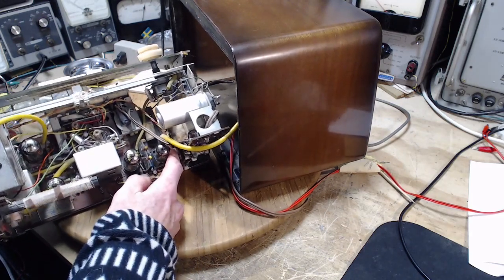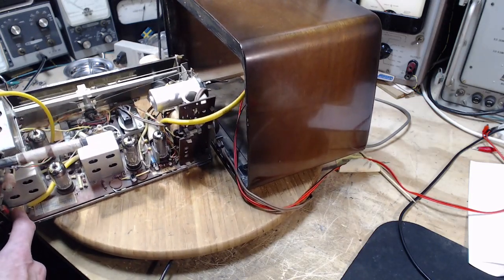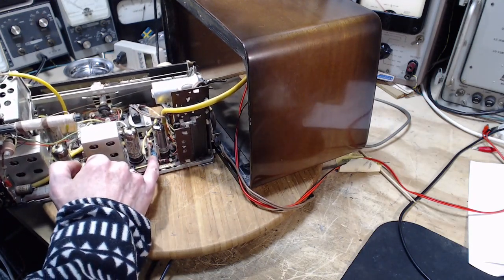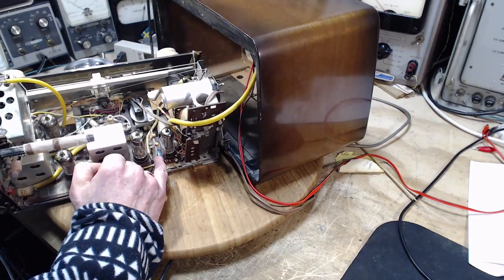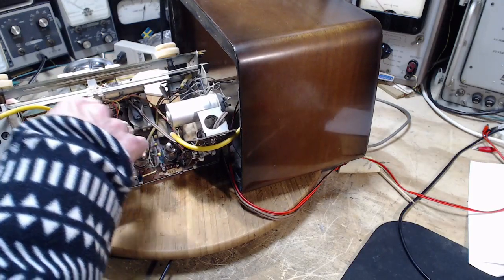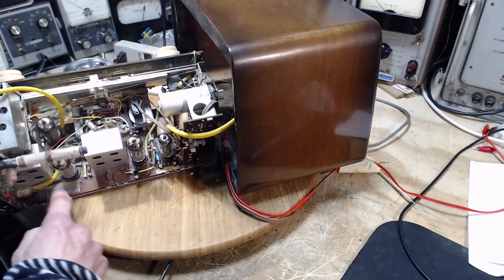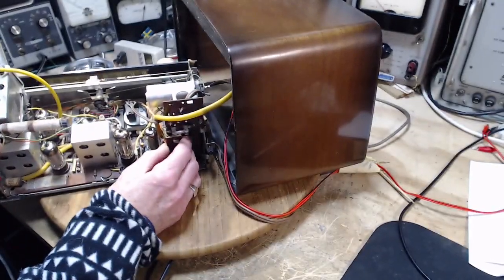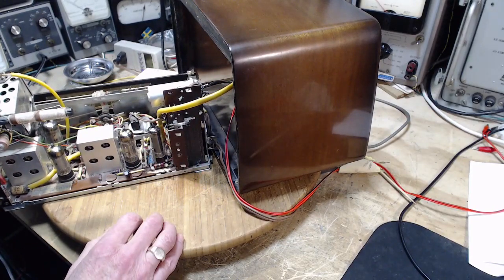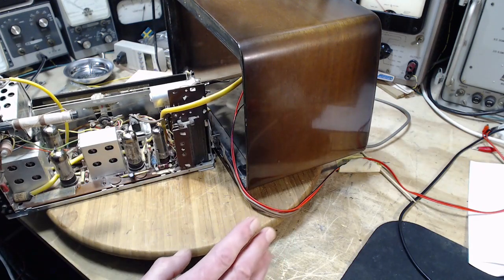Aside from that, there's one over here. It's pretty easy to get at. And wasn't there another one? So there's an electrolytic one here I'm not too worried about, in fact. Beyond that, there might be the smallish capacitors all in here, I believe, are high quality ones that tend to not fail, but I'm not sure of that. These ones are low quality, for sure. And the one you can't quite see back here is also known to be a failing kind of capacitor. So I'm going to do that. I'm going to change those capacitors, cross my fingers, see if this tube noise goes away.